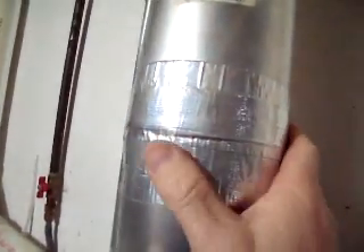Then we go to a rigid metal duct, and this is not regular duct tape. There are a couple pieces of gray tape on here, and here's some foil tape. If we go up a little bit further, you'll see that most of this tape is actually made for ductwork — it's not actually duct tape. It's heat resistant and will stay in contact with the surface. It doesn't crystallize like regular duct tape does.